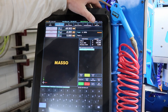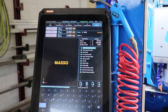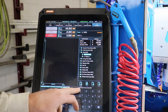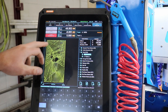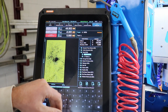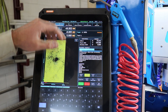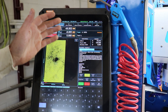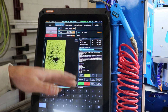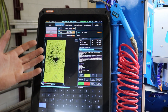If I move over to the load file tab, this is where I can load any code from the flash drive connected to the unit. I would just go through here, load that file, and down here it's telling me it's loading the code and showing me what that operation looks like — all the center lines of the tool movements. It loads and tells you the travel lengths of any movement. Once it's fully loaded I can go back to the program screen, see all my code, and if there's a tool change required it'll probe the tool before it runs that pass. As it's running it'll tell me what percentage of the operation is complete and show me roughly what it's doing.